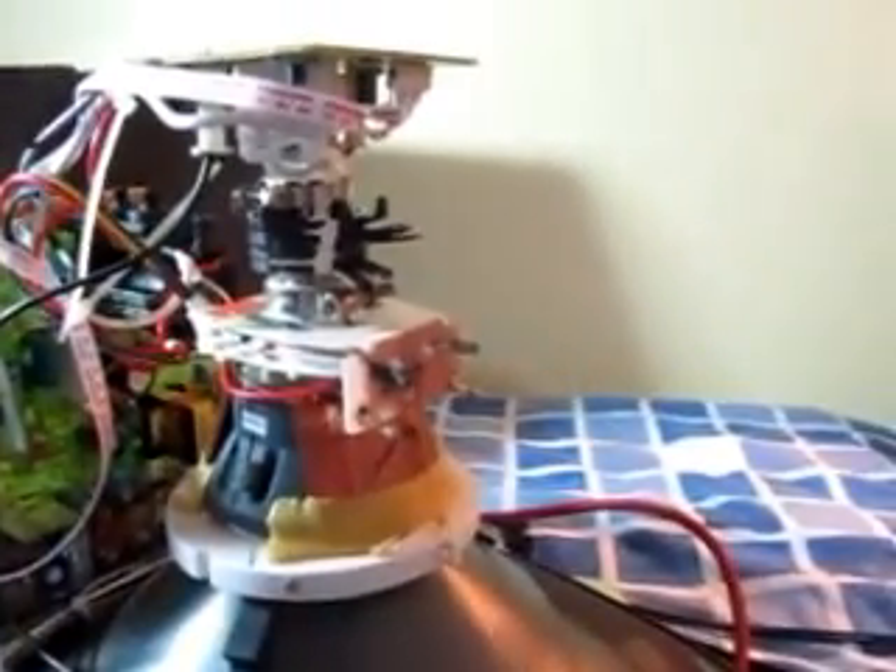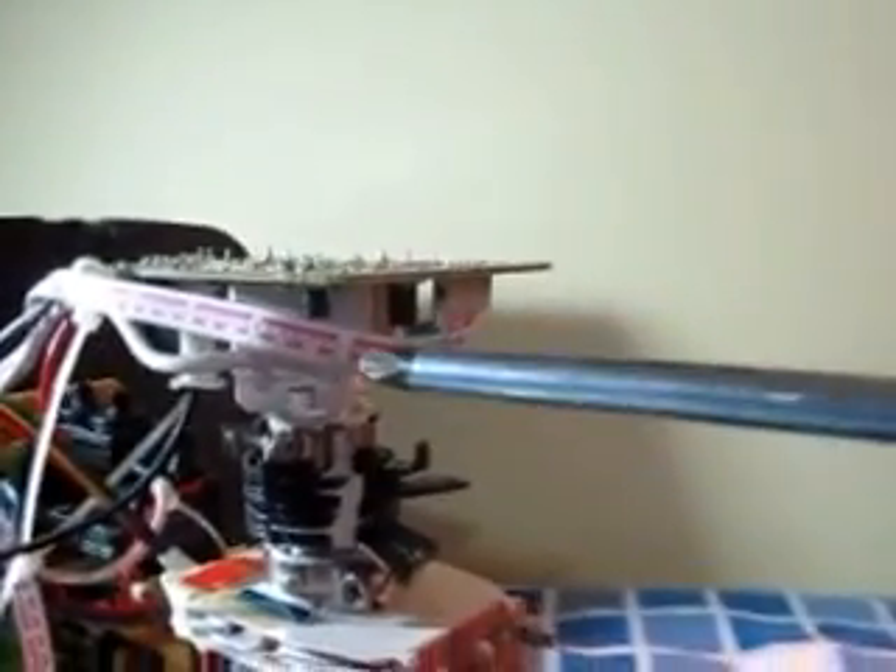Now, here we've got our anode. Cathodes and anodes are commonly used as terms for negative and positive on batteries and other devices. Up here we've got three cathodes — one for each of the appropriately coloured beams. But the beams aren't coloured; it's just the phosphors they hit. Down here you can kind of see inside the tube. I believe you can see the shadow mask in there — it's essentially a big metal mask, about half an inch behind the screen, with millions of little dots. They align the electron beams with the appropriately coloured phosphors on the screen to produce the images you see.